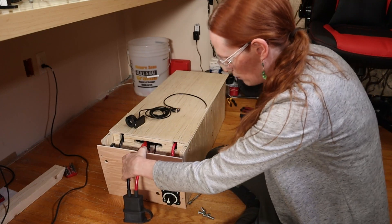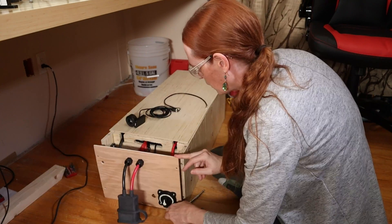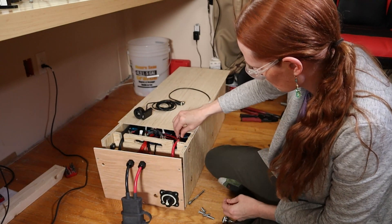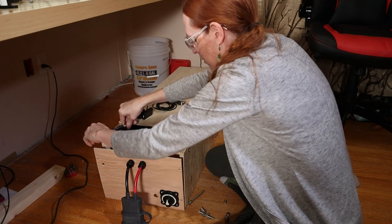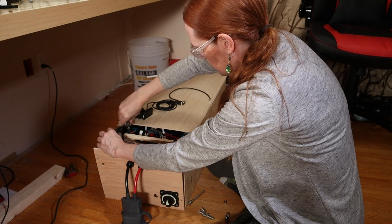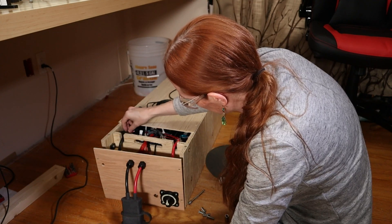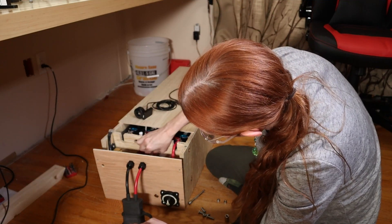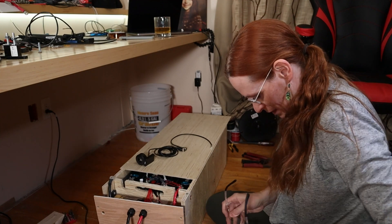The BMS is off but power coming off here is still available, so time to start getting careful again. I had done it so this could swing up. I'm going to take this off to make my life a bit easier. I should take the ground first — I don't know how sensitive it is. If I pull this wire off I'm going to lose one of the pins; will that cause a problem? Well, here goes nothing. The BMS shut down — disconnecting the negative first worked. If it doesn't work for you, don't do that. It's JKBMS — a lot of things are very appealing about it, a lot of things are not.